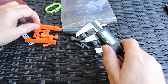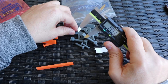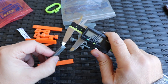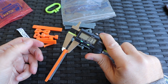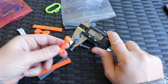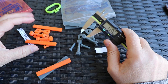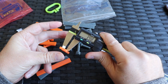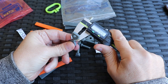Quick check of dimensional accuracy: 10.09 — acceptable. This one also 10.09, very similar. This should be 4 millimeters, and the diameter should be 6 millimeters — that's close enough. So the results will be comparable because the dimensions are very similar. This one should be 4 by 4 millimeters — measuring 4.09, very accurate. Good work, Samuel.